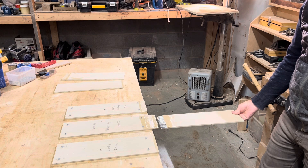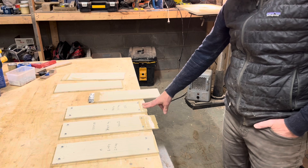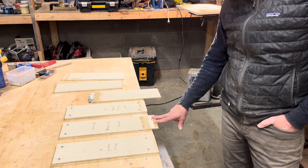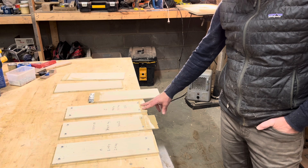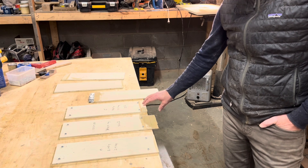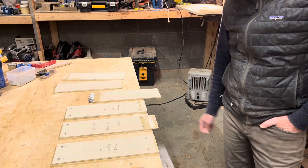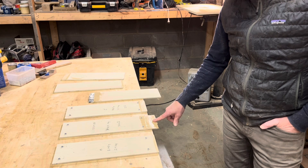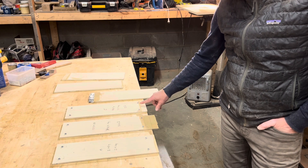The fiberglass is stronger than the plywood, but considering the weight of this compared to that, it's only seven grams difference. This probably makes more sense for many applications. There's a place for both on a boat — it's just a matter of putting the paper where you don't need a lot of strength, but it is good at sealing. I've never had water penetrate through the paper. I've never had wet plywood on any of my boats — I've had three boats and left them out in the rain for two weeks with no damage. So anyway, the fiberglass is a lot stronger, and the paper does add 52%. Thank you.